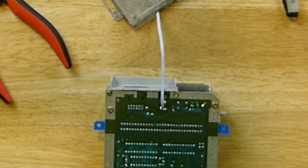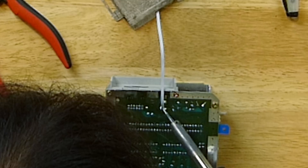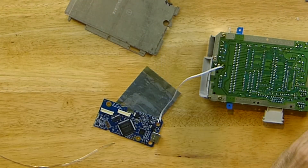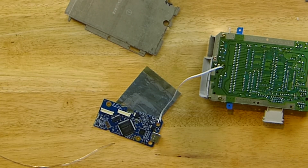Repeat the same process for the CPU mini board, but flip the socket placement — double-sided on the upper holes, chip sockets on the lower. Now take the 28 gauge white wire and solder to the left and middle holes of the 7805. The middle hole is ground, the left hole is power. Mark one so you remember which is which. Then solder the wires to the 5-volt and ground pads of the HDMI board.